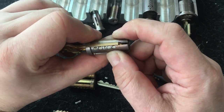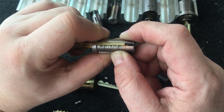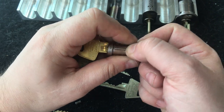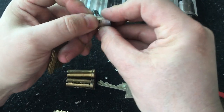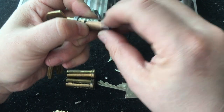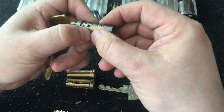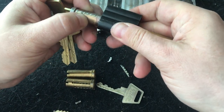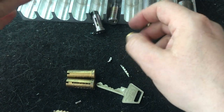We can see that we now have a sidebar with an ultra-narrow gate system again - so we went from the wide gate back to the narrow gate. On top of that we now have ten sliders, which are no longer spring-loaded. They are funneled in by the tip of the key and set in different heights. As this is for the end user, there's a limited configuration. For companies we used the DP.